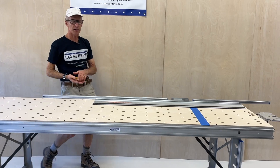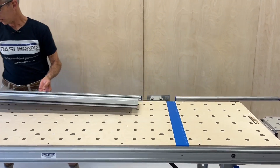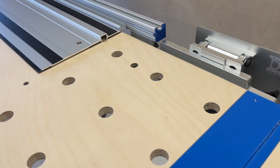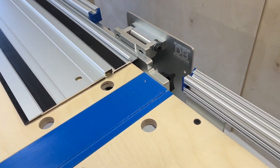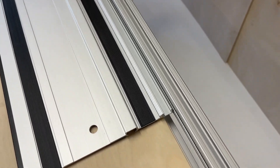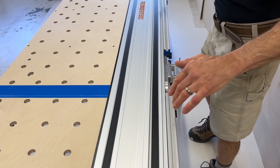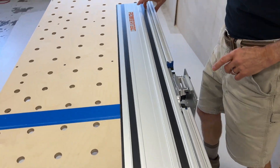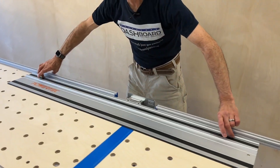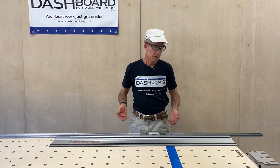Now we should all be in the same line. The simplest way to check that is to get the guide rail on here, pull it up against the fence, and run it down — feel it and watch it as it comes in contact with all three surfaces. You can see I have no daylight between the rail and any of these three surfaces. I can also pinch here and pull a little bit to one side and the other — it's not rocking. This indicates that we have been successful.